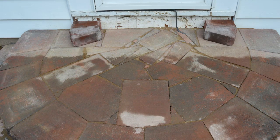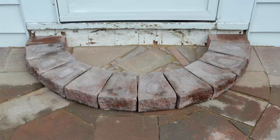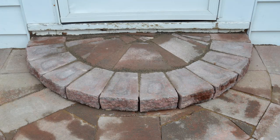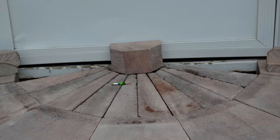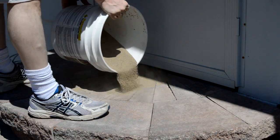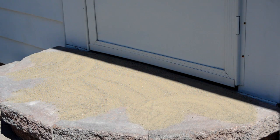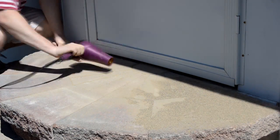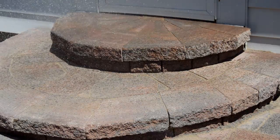Next, we lay out the bricks we prepped earlier for the base of the top step, and use landscaping adhesive to secure them in place. Fill with scrap bricks and more leftover tiny rocks — dirt stuff. Once the base is done, we lay out our capstones we already cut, and then do some maneuvering to get the best fit and look. The last piece to cut is the center of our half circle. Almost done — we lay out the final coating of sand, massage it into the cracks just like before. Cleaning up the sand, I wanted to do a better job than I did on the first step. The internet recommended a leaf blower, but all I had was a blow dryer. I had my best success using a soft-bristled paintbrush. More water to get the sand to set, and we're done.